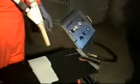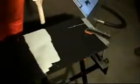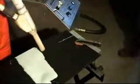The best way to clean with this process, unlike other media blasting processes, is that you want to be moving the nozzle at the speed that it's cleaning, no quicker. If you start going backwards and forwards over a surface trying to get it clean, all you're doing is wasting ice. So basically, get to a nice distance, 60 mil if you can, from the surface, start blasting, start cleaning, and just move the nozzle nice and steady across the surface. Move it along a bit, back, in, back, and just keep doing that.